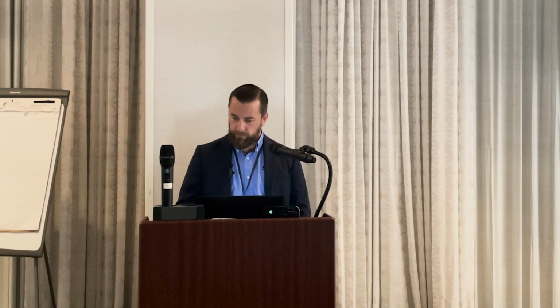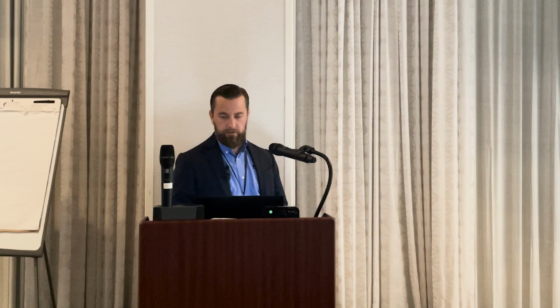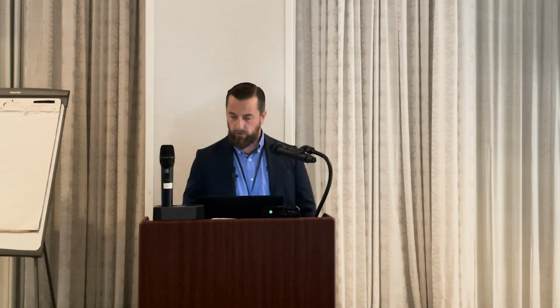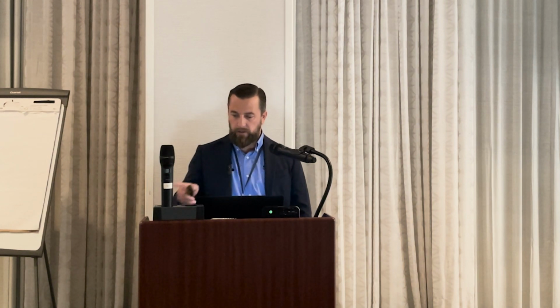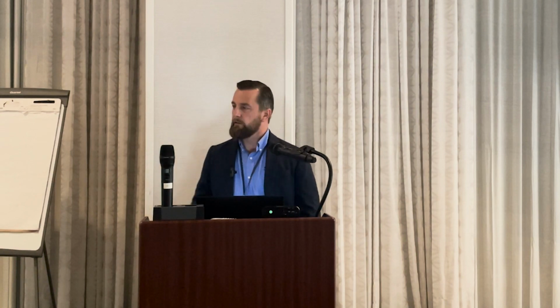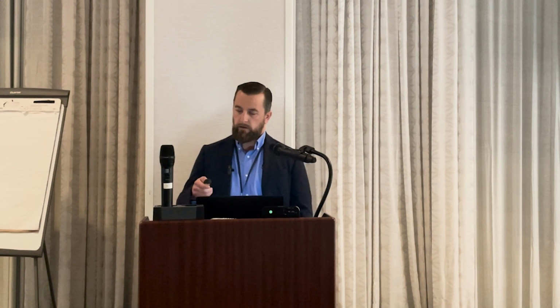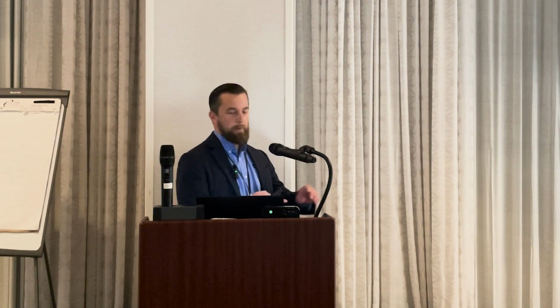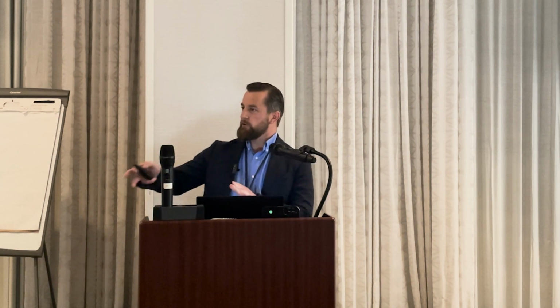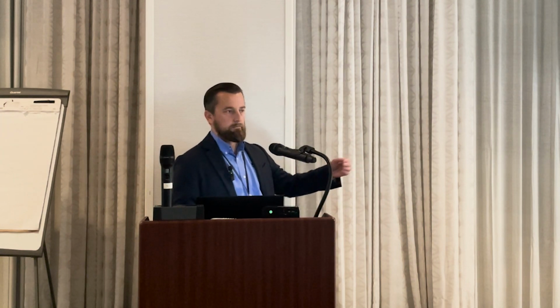Use certified bonders, people who specialize in FRP, not just guys from the local hall that don't know anything about FRP. They can't even spell FRP. In the sense of predicting failure, there isn't one tool out there that works perfectly. There are just a lot of joints in the system. You cannot check every single joint. The magnitude of the stress plays a part. A lot of non-destructive UT might just look at pipe.